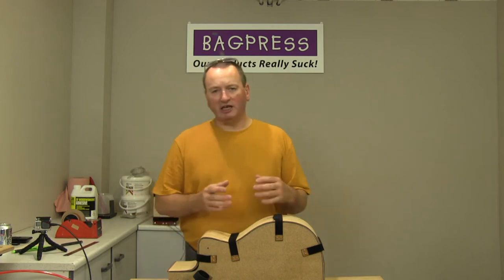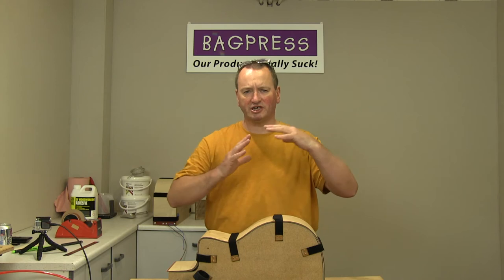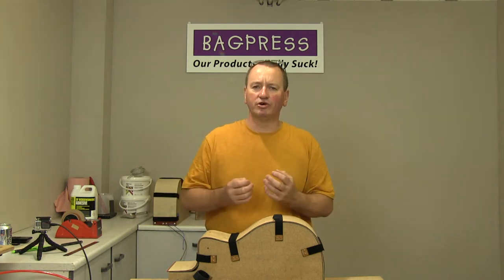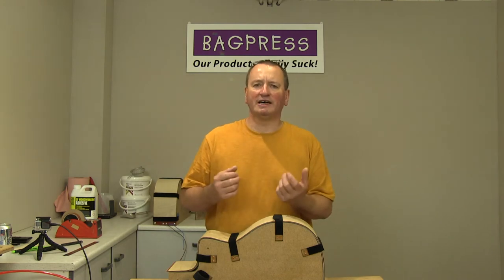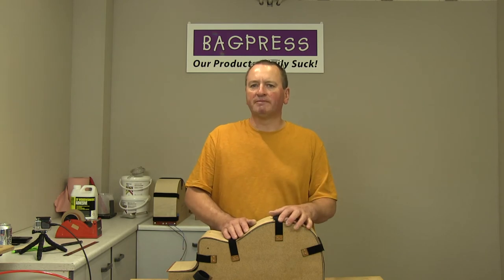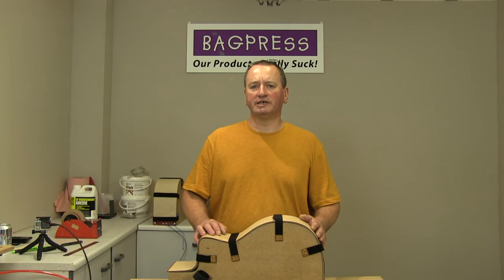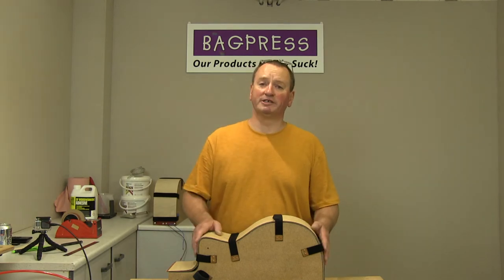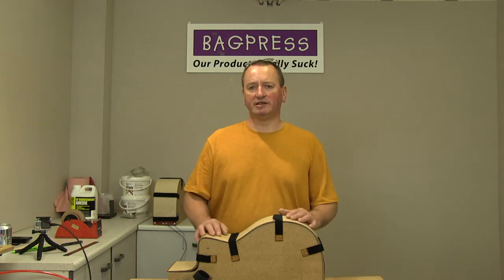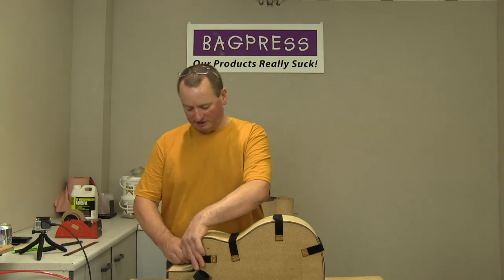What that does is it gives the material the opportunity to form as tightly into the mould as possible, and for the adhesive to be squeezed into the grain of the wood without it having been activated, without it starting to go hard. So I'll give it 10 minutes of just pressure to fully bed down and settle, and then I turn the power on to the heater pads and leave that going for 20 minutes. Then I'll turn the heater pads off, leave it another 20 minutes, and then we can take the sides out. So there's going to be a few breaks in the filming.